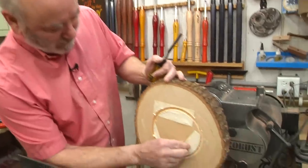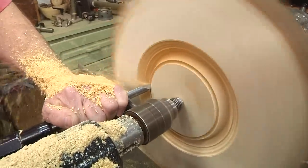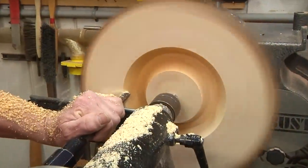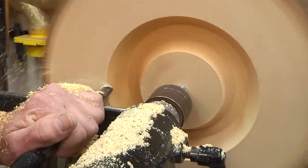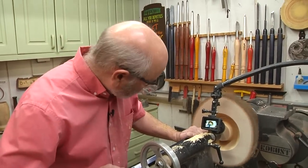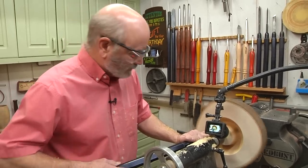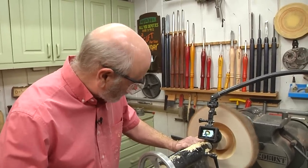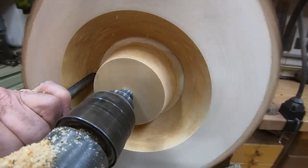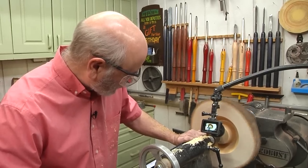The next step is we're just going to start hollowing this out and go a little bit into the bottom piece. Now we're broken through to the next piece, and you can see I really slowed the lathe down. We found out on the first piece that if you keep the RPMs up too much, it can actually flip the ring off. It didn't do it, but I saw some cracks appearing on it. So we've taken the lathe really slow — we're at about 100 RPM. I'm just going to get a clean intersection here, then pop this off, pop the center off, and work on the base.